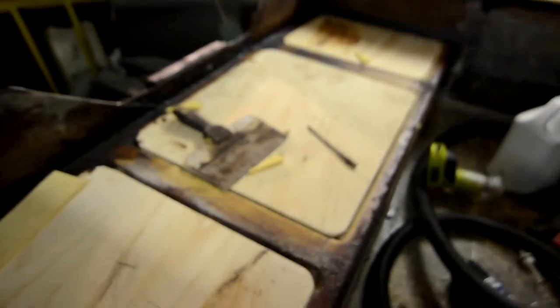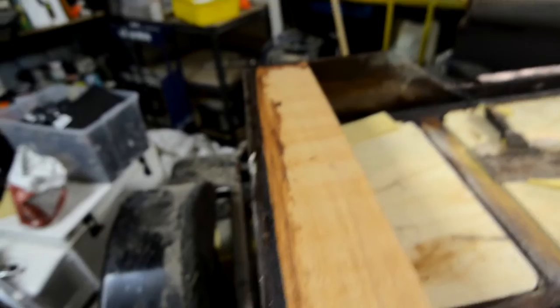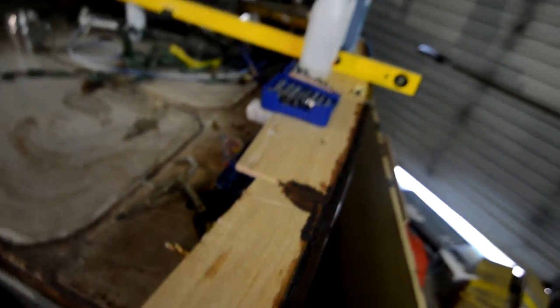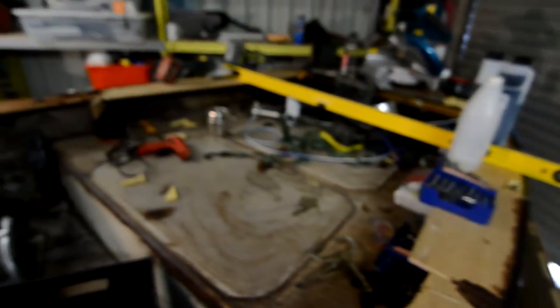So it's going to be a flats boat — she's going to run pretty shallow. It's got a rear casting deck, and some hatches here I'm still going to have to glass up. The hatches at the front I've already glassed. They're sort of ready for carpet and ready for painting. At the moment I'm putting in these gunnels, so I've just got to cut them back to the right width.